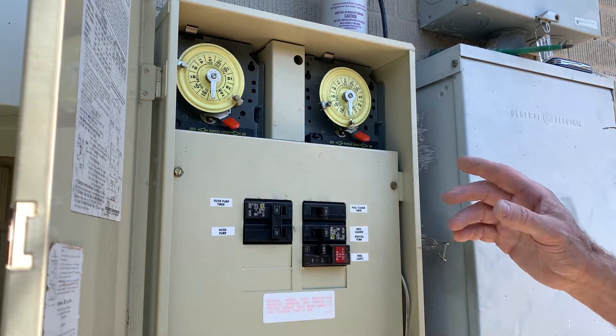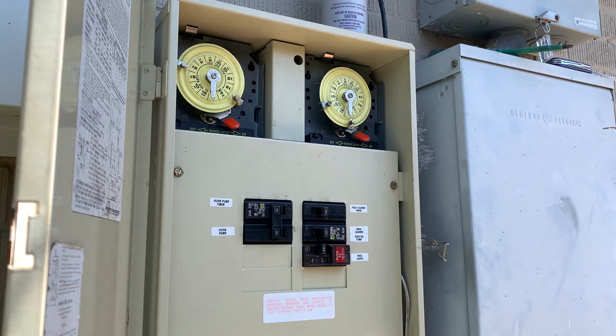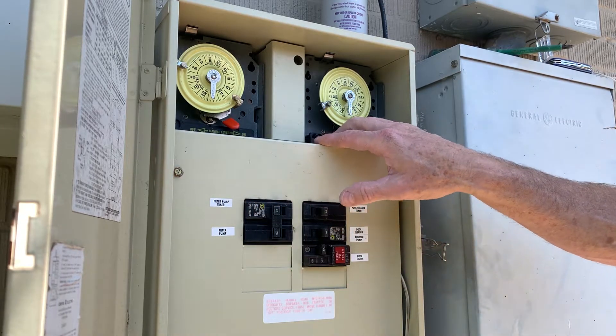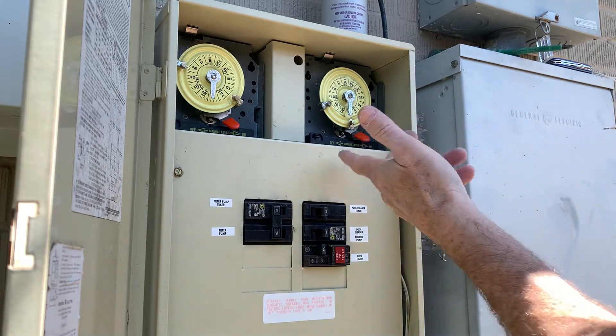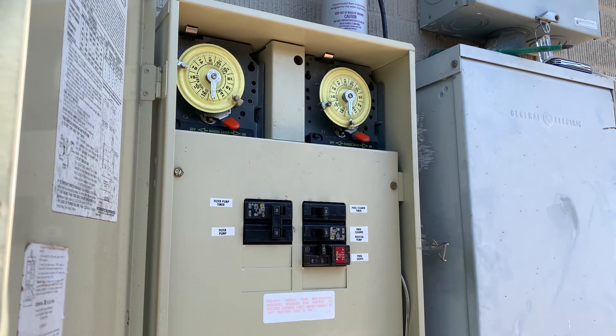In summary, make sure the main power from the supply to this panel is off. Once you have it off, turn all the breakers off. Remove the two screws and pull the panel out. Then push up on the tab, pull the clock itself out, replace the clock on the back, and hook it to the same two terminals it was on. Pretty much an easy fix and we're ready to start it back up.